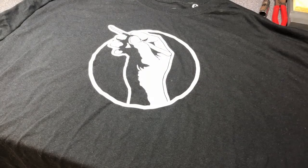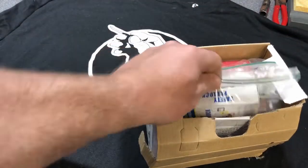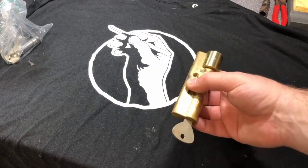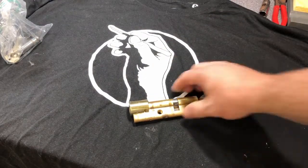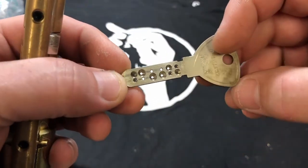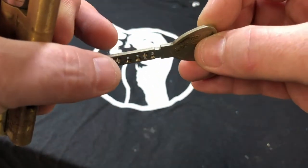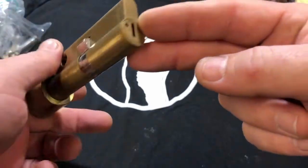Anyway, I'm not here to pick a lock. I'm actually here to disassemble one, but I have to find it first. Okay, so these locks had been lost for a little while. Here we go. This is the Banham. Some debate about the name, but by most measures it seems to be an M2002. This lock is something I picked on my channel quite some time ago. It has holes that are drilled all the way through the key, and then it has 12 directly opposed pins, and they move this way. So we're going to tear this down, get into it, and see how it works, and then ultimately how to pick it.